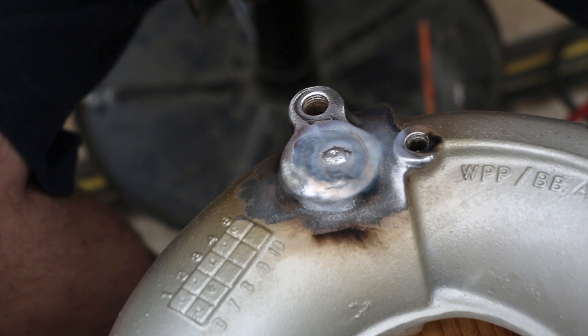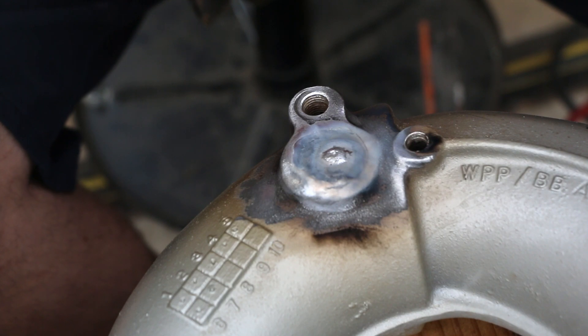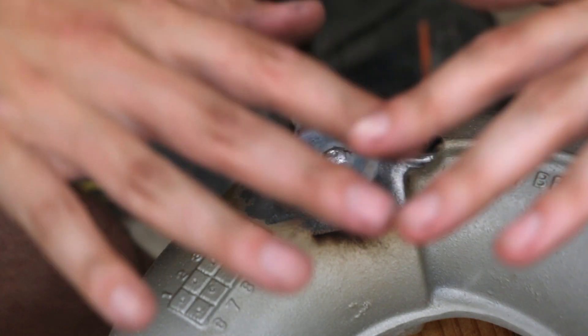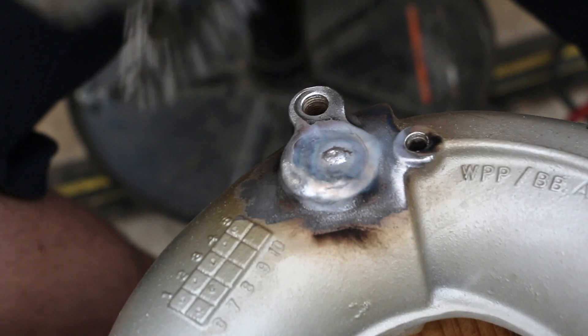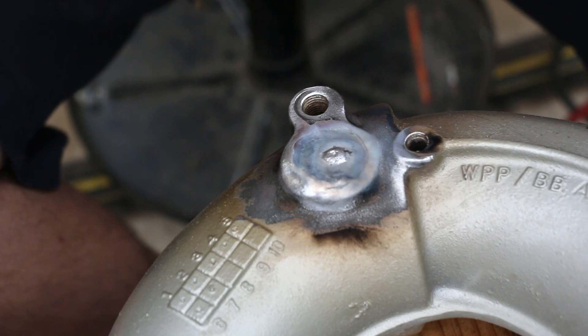I'm certainly no welder, but here's what we've ended up with. Aluminum sometimes seems to get random contamination and I don't know why, but usually stuff holds, it works, it doesn't leak. I made a little tower here in the middle because when you let off the pedal, aluminum tends to sink in — so if you add a little bit extra, it sinks into that extra puddle and no problem, then you can just grind that off later. I'm going to clean this up with a stainless steel wire wheel that I've only ever used on aluminum, so I don't think that's contaminating anything.